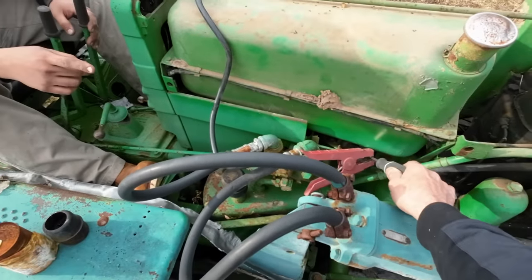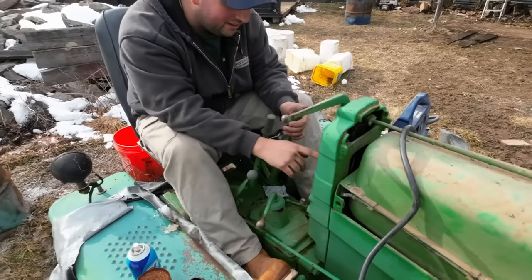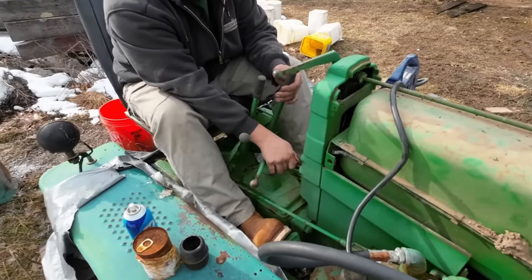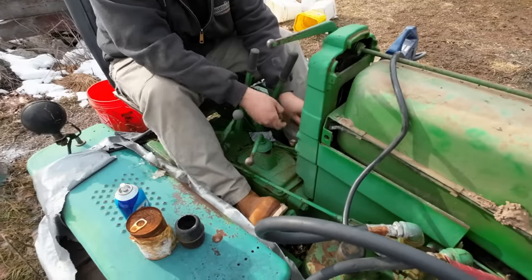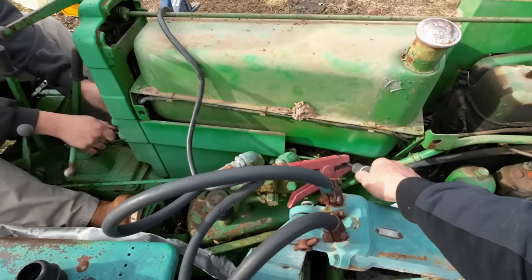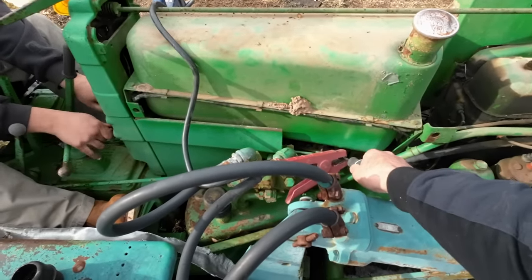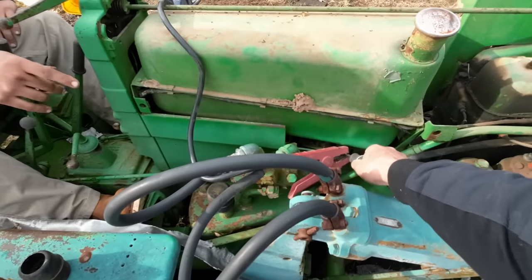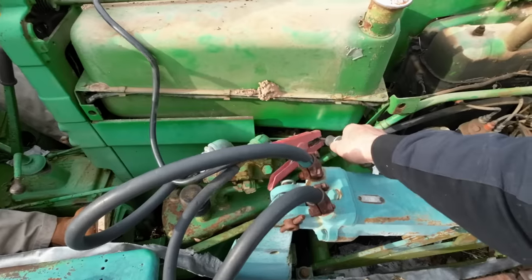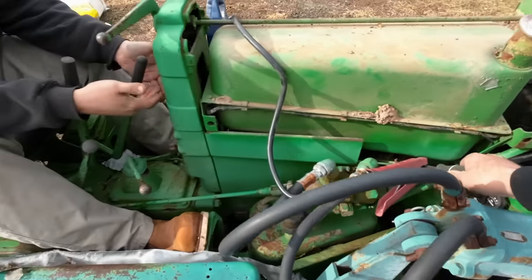So where are you putting power to? Right there. Okay, so I have a light here. And the amp meter's jumping around a little bit, but the starter's not going. Gotta change that. That's lights. Nothing. Is there a direct line to the starter? No, well, the switch is kind of concealed. I'm just putting it right on the lug there. That's what's making it light up. Is it lighting up now? Yeah, I have a light on the dashboard here.